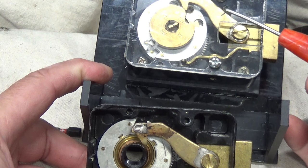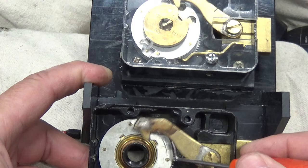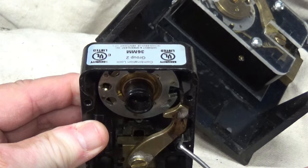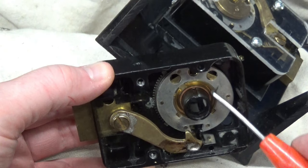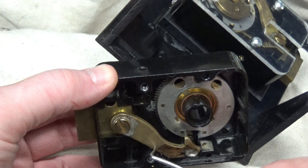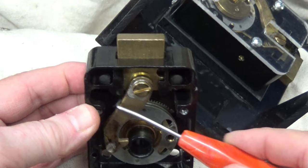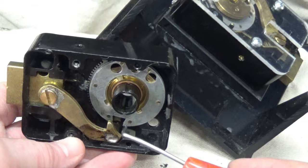But what if that spring breaks, or the spring is so worn it's got no power left in it? Well, gravity is still going to do it — if it's handed like that, yes it will. However, on these safes they can be handed differently. If that spring has got no pressure and you dial it correct, what's going to make it go in there? If it's handed the other way — very common, there are one of four ways to hand a lock — if that lever spring breaks with no pressure to pull it up, you've got to call me. Same with vertical up — even if it's dialed right, it's not going to pull itself in.